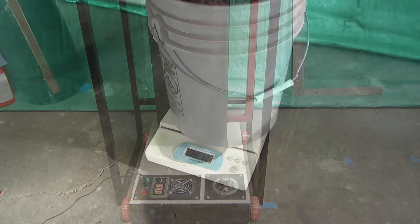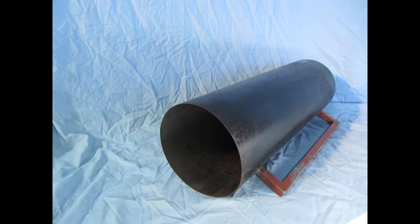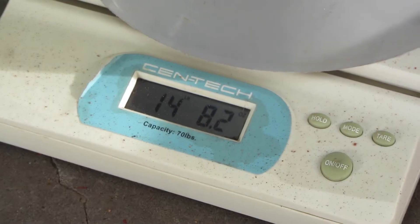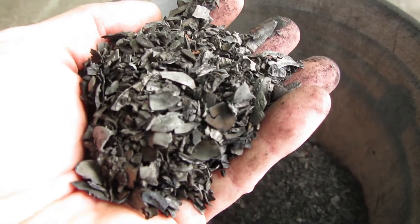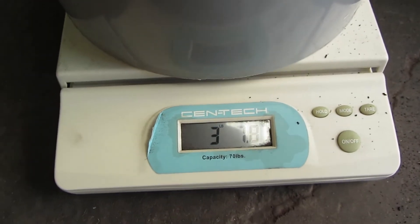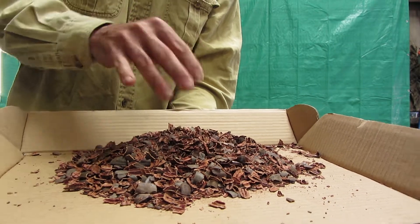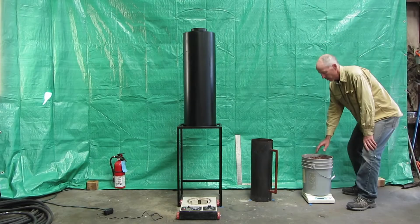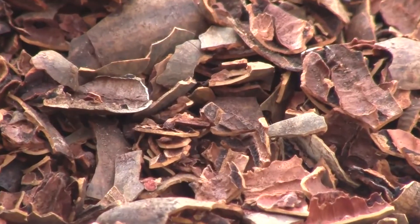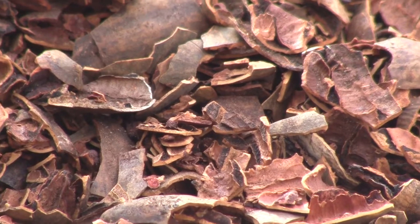This bucket has been prefilled with a full load from the 8-inch burn chamber that we are using. The load we are demonstrating today weighs 14 pounds 8 ounces or 6.5 kilograms. The finished biochar weighs 3.5 pounds or 1.5 kilograms, meaning that around 25% of the biomass has been left over to be charged and stored in the soil. Our T-LUD stove is capable of burning different types of dry organic materials, many of which are byproducts of farming, forestry, or thinning. In this demonstration, we burned pecan shells, a cheap and often available fuel source in the southwest United States.